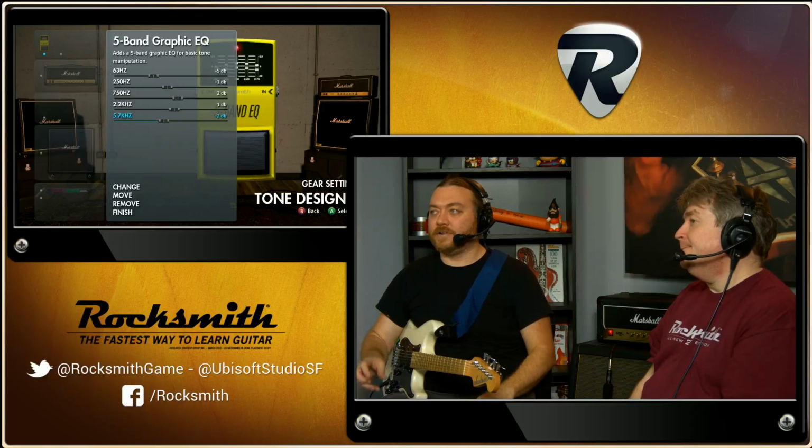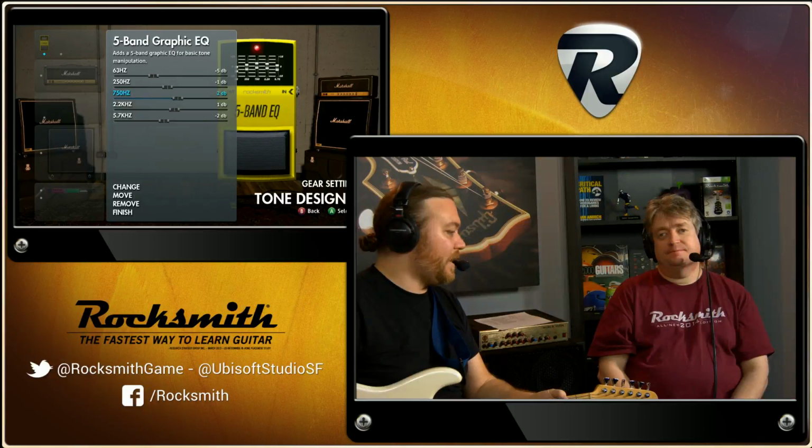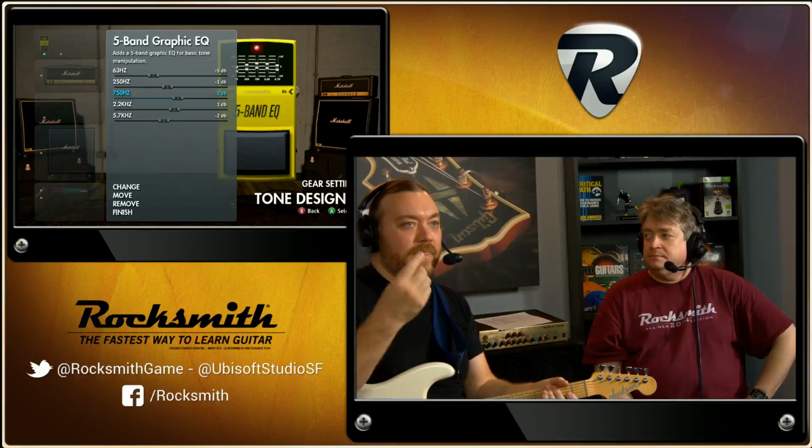What we've done is we've turned down the bass and we've turned down the treble, to get even more filtering in front of our distortion. And this Marshall amp even has some filtering. The reason we do this is because if you don't have a little filter before your distortion, it kind of sounds like fuzz. You have all this low-end energy going in and just getting amplified and amplified by that distortion circuit, and it gets messy. We wanted a little more crunchy, and so we have this sound.